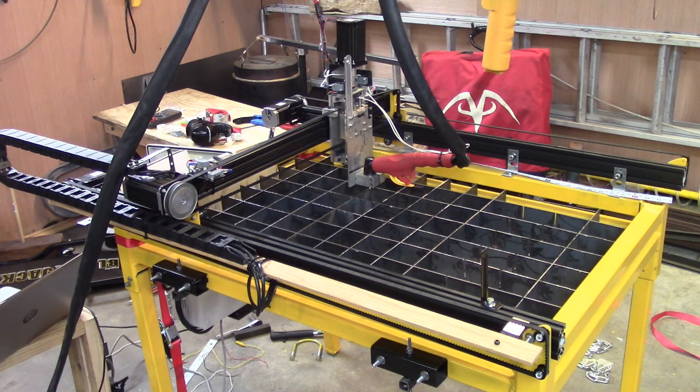So at this point, we'll check on Bubba and Cooter. And after all that testing I did with that solid state relay, I let the magic smoke out of it. And so I read more on this Smart Bob, and I just put the torch switch right onto the Smart Bob relay itself. And I don't need an external relay. It's doing a good job just like it is. From here, it's just testing to get the speed right.